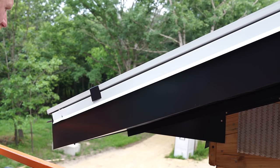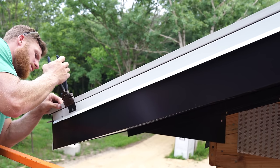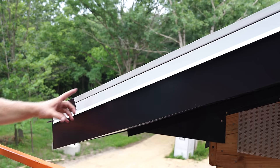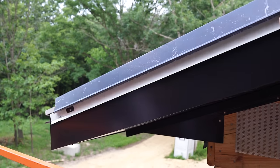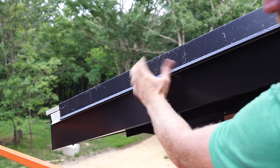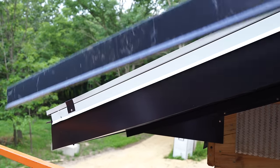Now I just have this bent piece of metal - it's going to go on top of this bend up that we did. We're going to push it down and install it. I'll take my hand benders again, make sure it's nice and tight. If the wind comes - I'm actually going to do this multiple times up this rake here - that is how we fasten that down. Then the rake trim is going to come over top and lock over this cleat right here, making it secure and giving it a nice finish. We'll do that detail at a later time.